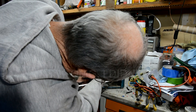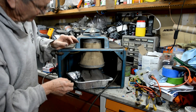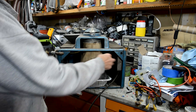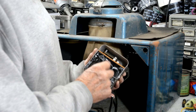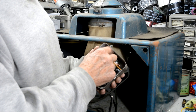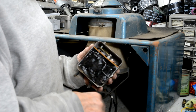I'm going to go ahead and change the unit in here. If I can get this open, it should swing out of the way and the bottom should drop out. Now I'll take the cover off and see how we can replace this unit. This was the old unit — you can see they potted it to prevent any moisture or arcing. Inside it looks just like a set of contact points with little adjustments. I think over time it's lost some of its strength, so it doesn't put out the spark it should.